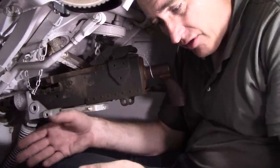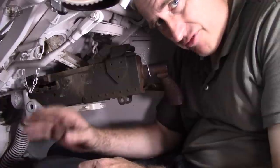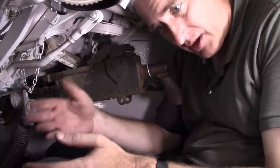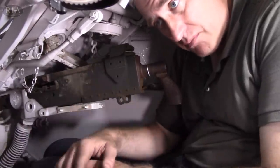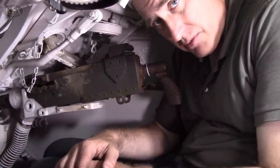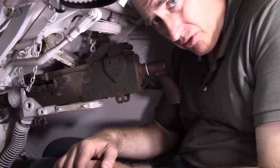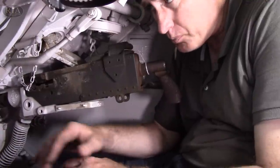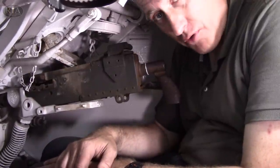Maintenance — well, at least it's easy to do top-offs and whatever. Basic maintenance has to be done every 250 miles, but 3,000 miles seems to be the big one. Both in the Hydromatic and the transfer case and the diffs, all the bands have to be adjusted and tightened. However, the good news is that most tanks didn't actually have to go 3,000 miles because in the Pacific the ships would take you most of the way, and in the European theater, you draw a 3,000-mile circle from Normandy and you're pretty much most of the way to Moscow if not actually there. So there you go — American reliability.